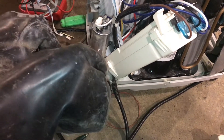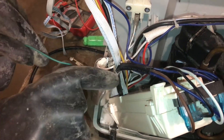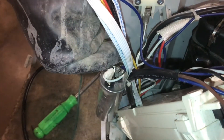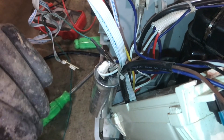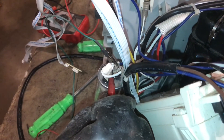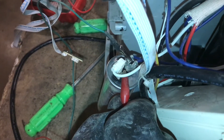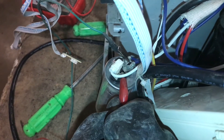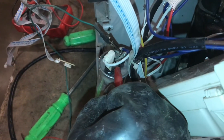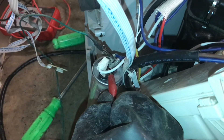Just make sure when you're doing this, you don't allow your clips to contact the metal can, because if they both touch the can they'll touch each other. So I'm going to clip the first gator clip on and then take the second one. It should not spark, because even if it was high voltage, 100 kilohms is sufficient for anything in the 120 volt range. This would take about 30 seconds to bring it down to a safe voltage, and after a minute or two it'll be fully discharged to zero.